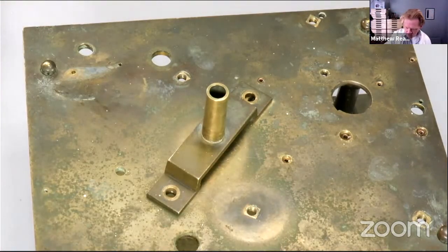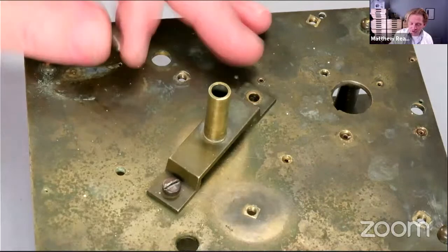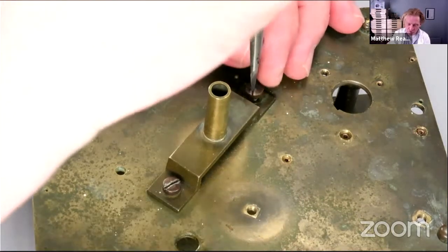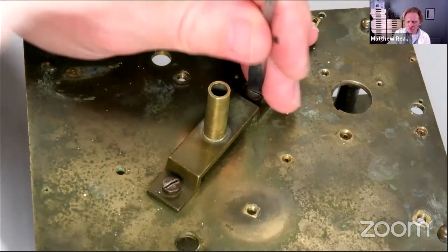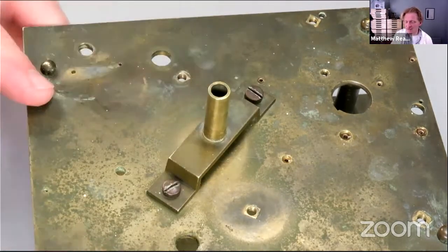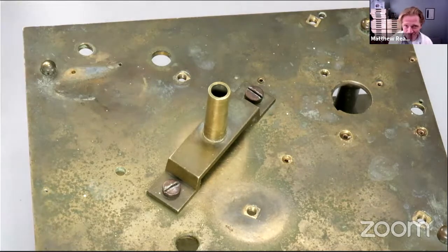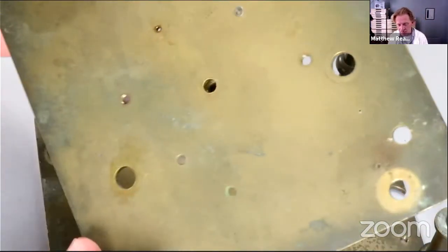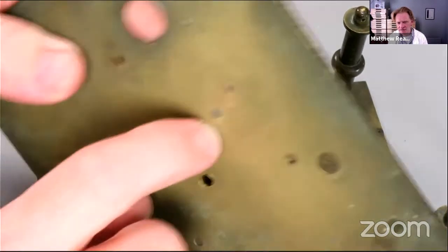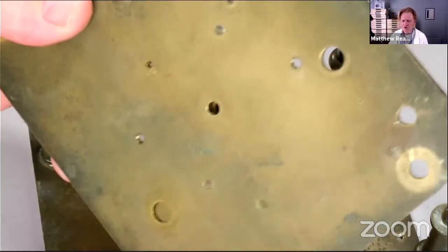Okay, so I had a pair of screws. Don't know whether these are the right screws or not, but with screws on a clock like this, they don't stick through on the inside much. So if you've got a clock, as inevitably all these clocks have been taken to bits 1,000 times, and you want to know which screws go where, just see how far through they stick on the inside of the plate. If they stick through a long way, typically they'll have a point on them. The center about which the thing's being turned will be left on by the maker. They won't leave a whole lot of thread. You never see that. Again, never say never, but it's quite rare. Whereas if the screws are like this one here, that's really convincing. It's pretty much just sticking through a quarter of a millimeter or something. This one's a little bit short, so maybe that's a back cock screw.